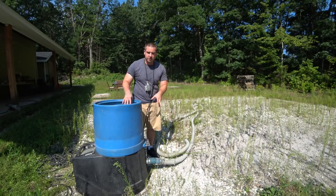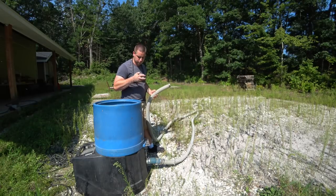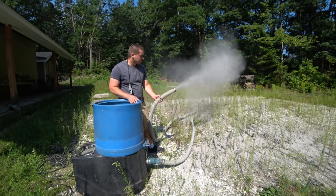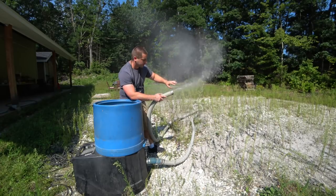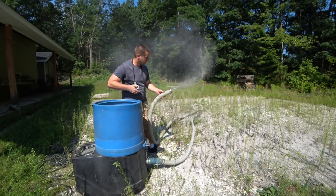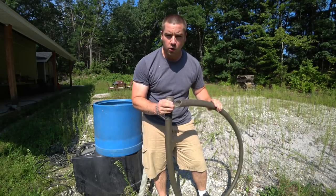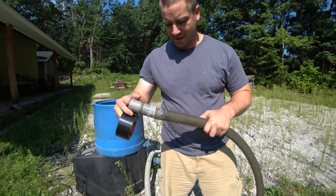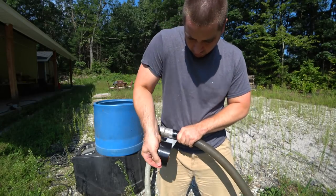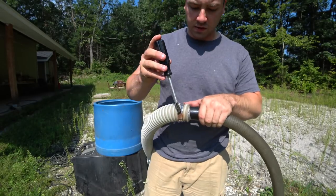Now we'll put the plate in. We have about an inch opening now for the cellulose to fall down. There might be a little bit in the airlock, but then you're going to see the difference — see how little cellulose is actually coming out at this point. It's mostly just air. Now for a lot of situations you're going to want to use this tiger flex hose, which has a one and a quarter inch inside diameter. The hose clamp came off so I'm going to retape it, slip it on, and tighten the hose clamp back up.